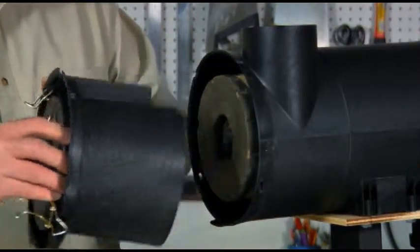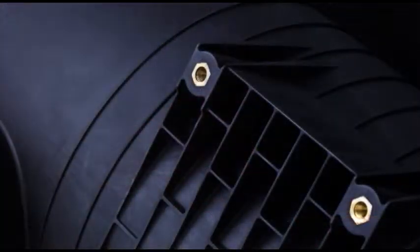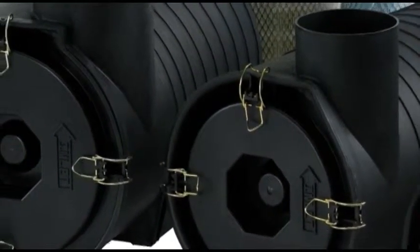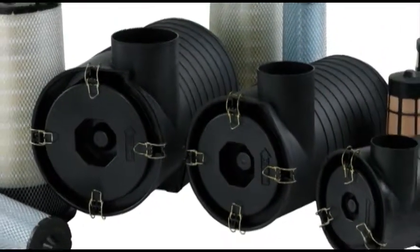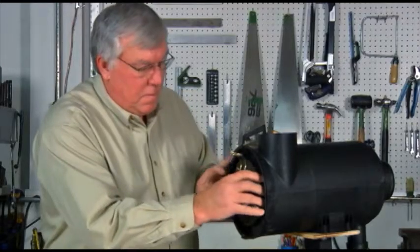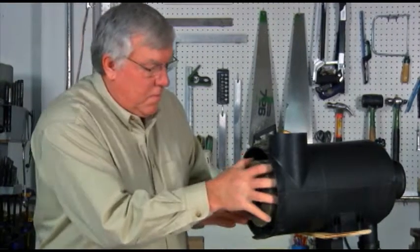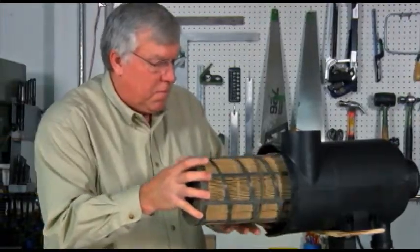The XRB Air Cleaner Series is a compact radial seal design with built-in mounting brackets. Designed for off-road equipment operating in medium dust conditions, the XRB is smaller in diameter compared to competitive brands with similar airflow. The XRB offers improved handling and simplified maintenance. Changing filters is easy. Here are the service steps.